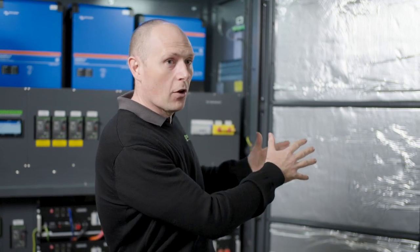what we could do is have a dedicated electrical cabinet with all the inverters in here, especially if we're using the larger 15 kVA inverters. So you've got all your inverters, your switchboard, your MPPT, and then we can add another cabinet onto the side that would be a dedicated battery cabinet.